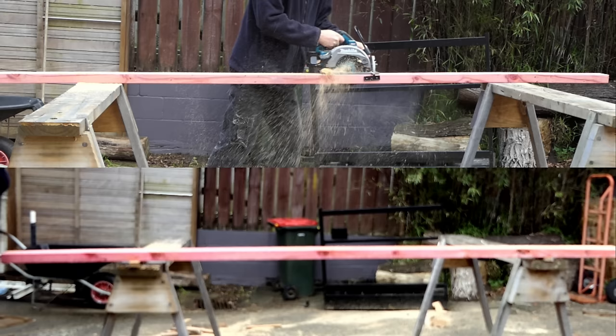When you're doing like 4 by 2s and stuff, if you're just holding them in your hand and trying to cut them with this, it's a little bit more annoying because all the weight of the tool's up the front here and your hand's way back here. When you're using a top-handled saw like this, the weight is right underneath your hand, makes it easy to hold and steer, and just do your cut with this. When you let it go, it wants to hang down like this because it's quite hard to hold it up straight with one hand all the time.